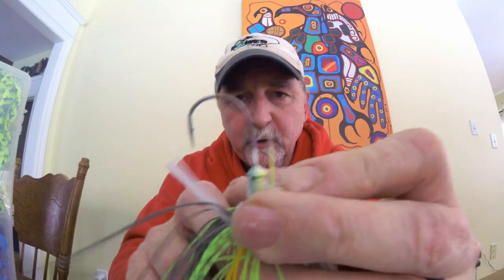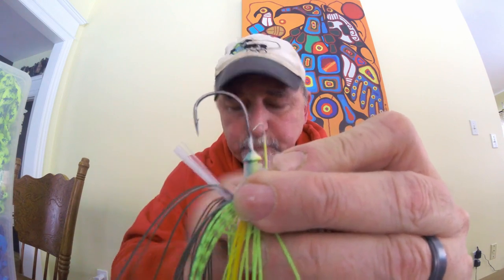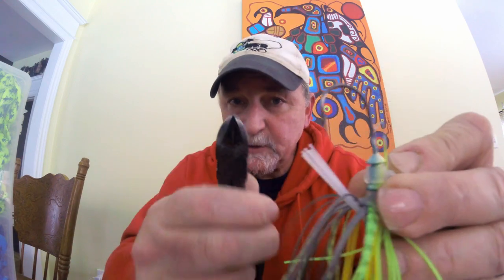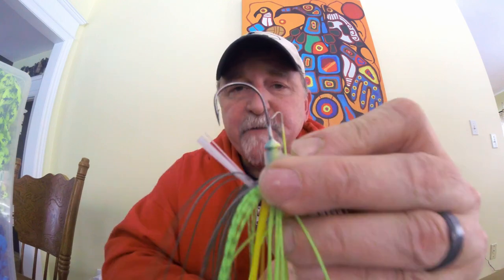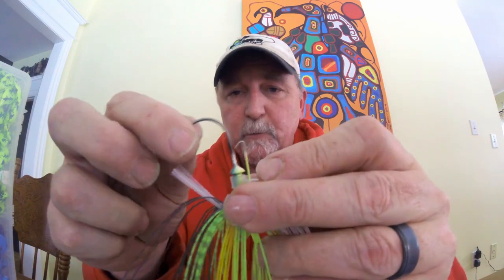The third type of keeper you may run into is the wire — it can be a little clip or a corkscrew. In either case you can clip them off. Just be very careful — this is spring steel. When you clip it, it's going to jump. So make sure you have eye protection on. You don't want to hurt yourself that way.